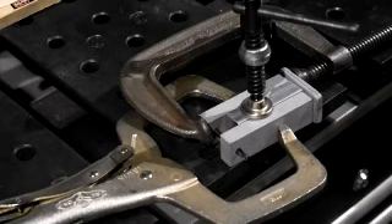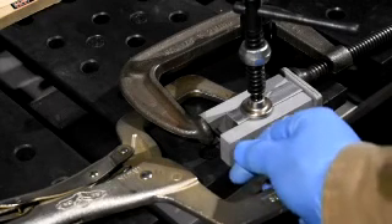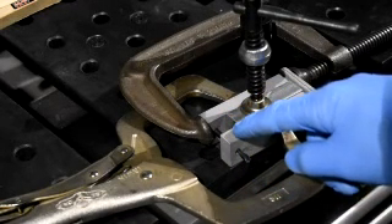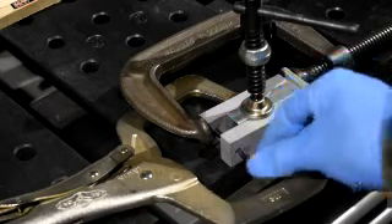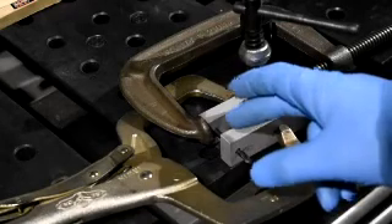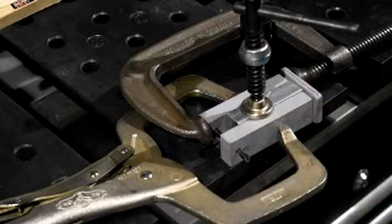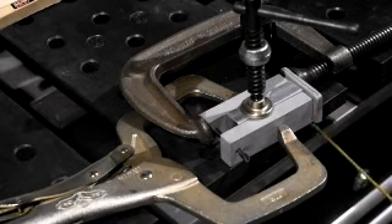So hopefully you can see I've got my drill bit lined up in these two holes and it slides beautifully in there, so I know that those holes are lined up. I like to use thicker material when I have something that's guiding a drill bit, because it's much easier to tell when the drill bit is aligned — you can feel it binding side to side. These little scrap pieces are half-inch thick, so I know by being able to slide that drill bit that those holes are lined up. What I'm going to do is put a tack right there, right there, and then all the way around it.